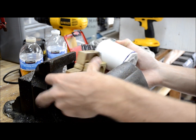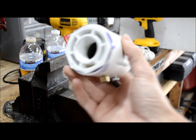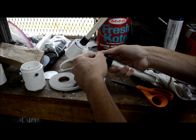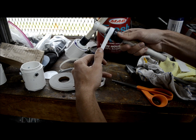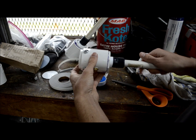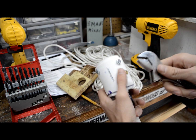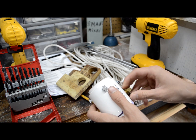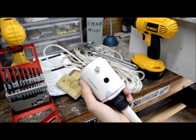Go ahead and take it out of the vise — you're pretty much finished. Take your bell tube and wrap it with some Teflon tape, then put it back in your horn. Now comes the fun part: take out your test fitting and you're ready to test it.